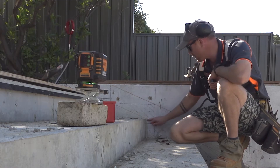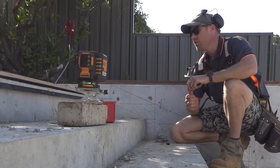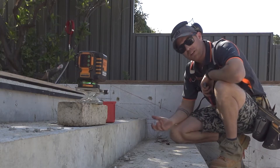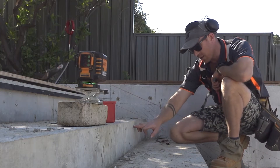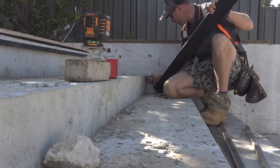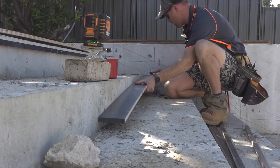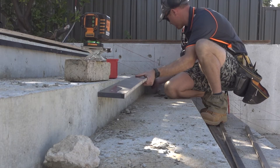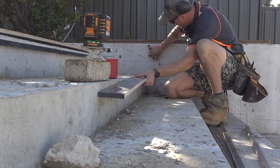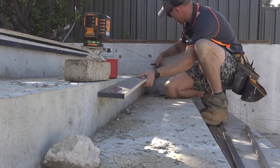So what we have to do is cantilever this stair over. I've thought of different ways to do it. Something I've had to think about is I also need a nice line for the concreter when he trowels this to get a perfect straight line. So what I've come up with is I'm going to put a strip in here, a little piece here which supports the soffit of the step, and then here I'm going to put another bit of ply, a timber behind it which is for the vertical part of the stair.